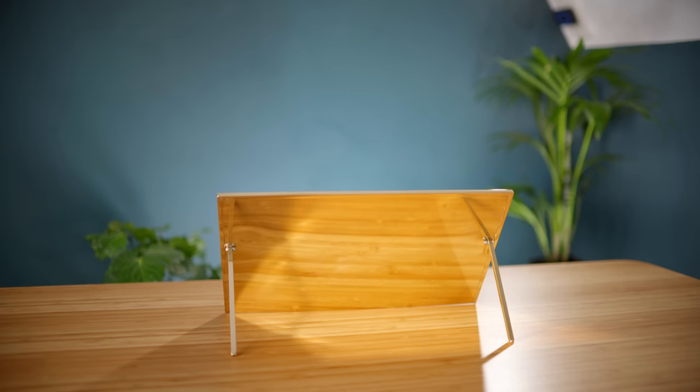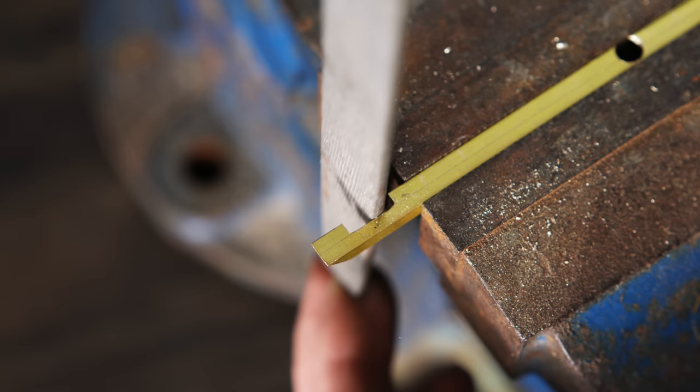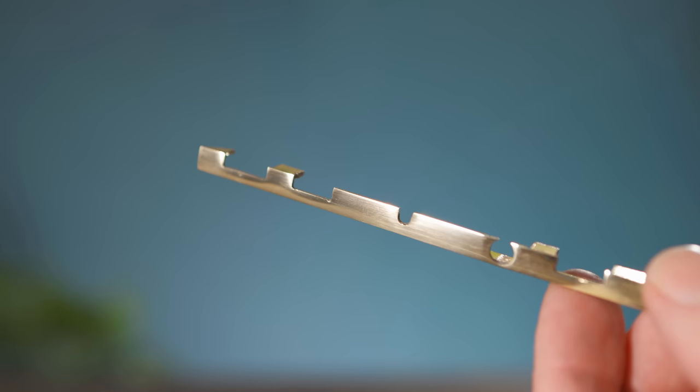It's nearly time to add the LCD panel, but first a little chamber needs to be made on the back to house the display's control board and battery. U-channels are again useful for this, though one side needs various cutouts that line up with the ports on the control board. Brass is very workable, so it's pretty easy to make quite a precise fit even using basic tools.